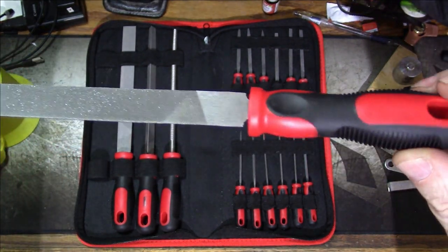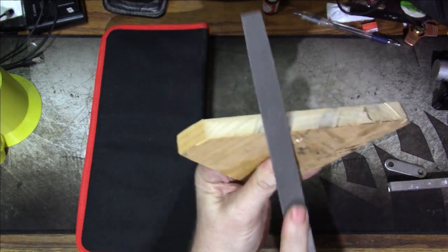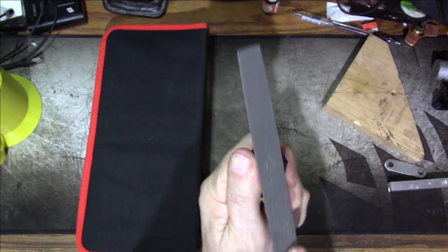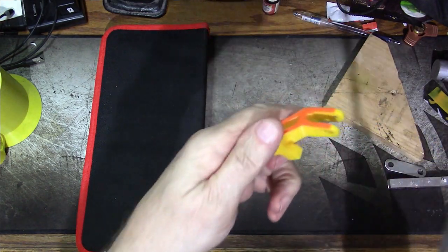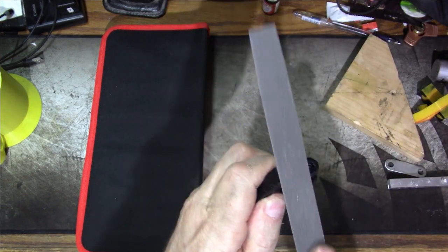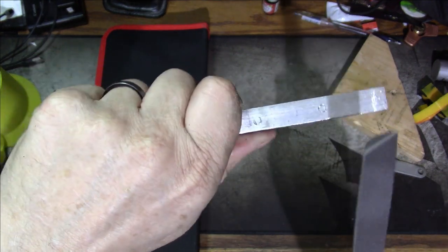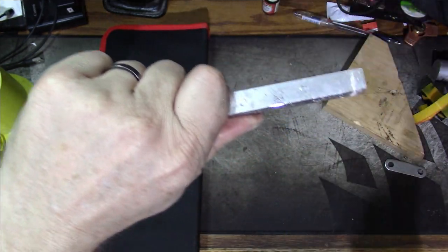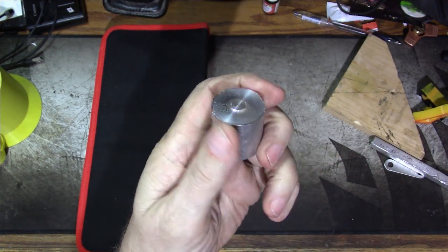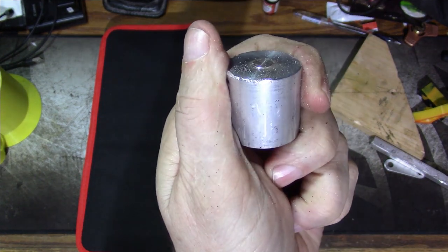So I've got some material here. Let's test it on a couple of different kinds of material. Let's start with wood — yes, it cuts into wood really well. Here is some acrylic, and not shockingly enough, it cuts into the acrylic really well. Here is some PLA plastic — and it does cut into that. Here is some ABS, and it cuts the ABS very easily. Here is a piece of aluminum — I have no idea what this aluminum is, something I had laying around — and it does cut quite easily into the aluminum. Now here's a harder piece of aluminum. I bought this for a project a number of years ago; I forget the grade, but it was a higher, harder grade of aluminum, and I can do it without skating. You'll see it cuts into that aluminum quite easily.